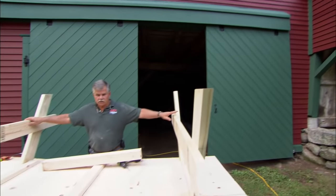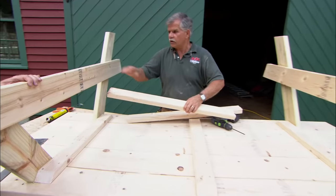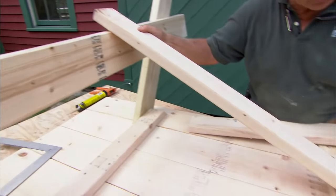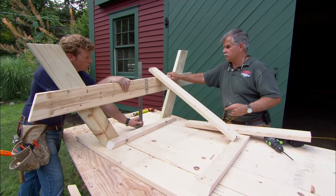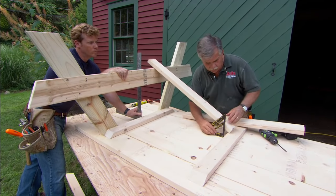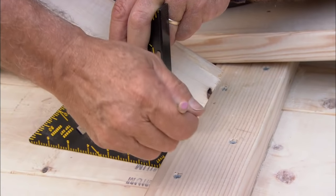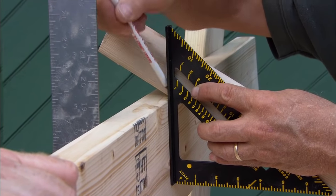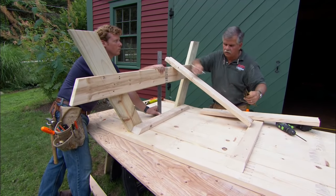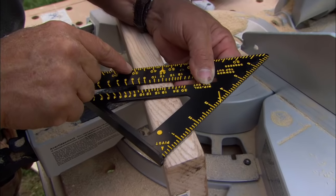Now to stiffen up the legs on the table so that it won't rack and collapse, we have to install a couple of diagonal braces. It's going to run from this cross brace right here down to the center cleat. So the first thing we want to do is hold the legs square with the underside of the table. Next, I want to take my square, hold it tight to the table and tight to the cleat, and mark my brace. Then I take my square against the cross brace and mark my square here — that's the angle and the length for my brace. To get that angle, I'm going to hold my square against the edge of the 2x4, line up the line, and read that I have 30 degrees.